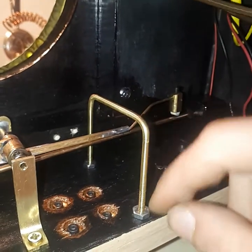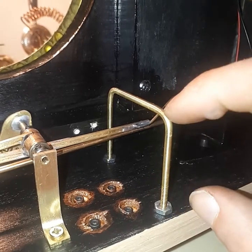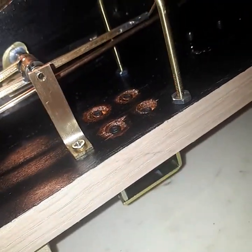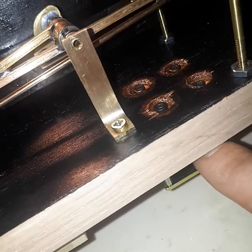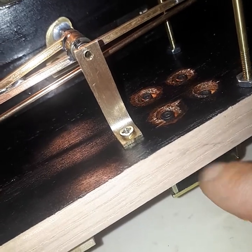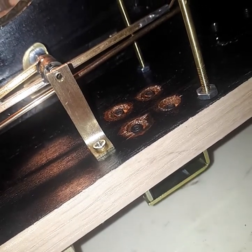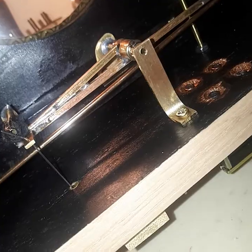This is one-eighth-inch rod threaded with a 6-32 thread die — solid brass rod — with some 6-32 nuts. The solenoid is a chassis-mount open-frame type. It mounts with four bolts, and I've added two layers of craft felt just for sound insulation. This is three-quarter-inch oak board, again for insulation. I had some quarter-inch plywood initially and it just had an unreal sound reverberating through it, so I had to rebuild and redesign. Under my L-shaped bracket here, you can see the felt underneath as well — just a single layer. I've got a grommet in that hole and the filament goes through it.